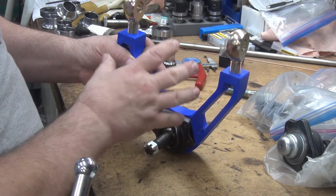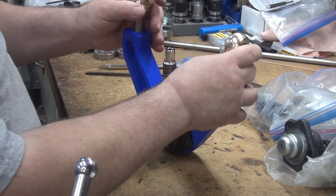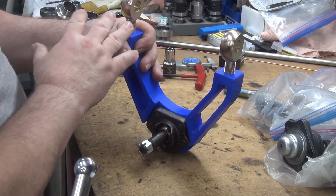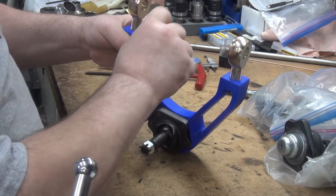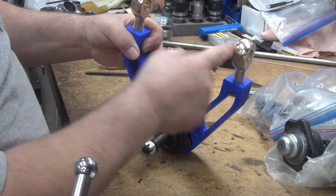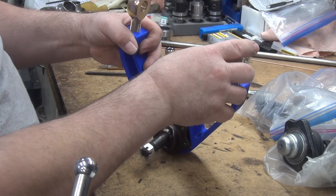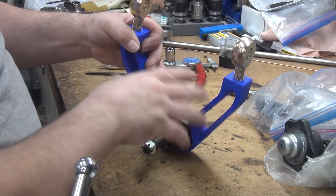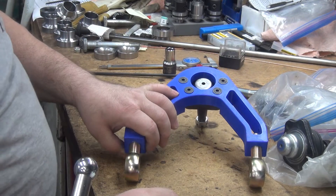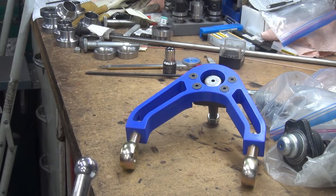With the two-piece there's going to be just a little bit of flex — a few thou, ten thou at the most — which is basically what's needed. Because if these holes are off at all, if the cross shaft is either too wide and pushes the balls out or too narrow and the bolts pull it in too hard, it will bind the heim joints, and I don't want that. So I'm going to do the two-piece style.